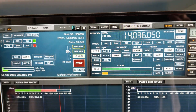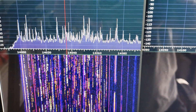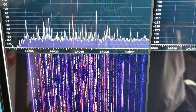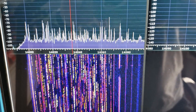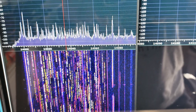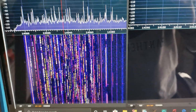Same frequency on the radio. As you can see, there's a CW contest this weekend, so there's a lot of signals on 20 meters right now. I'm actually decoding 192k of bandwidth, so I can see the whole CW portion of the band being decoded in real time. That's the pan adapter.